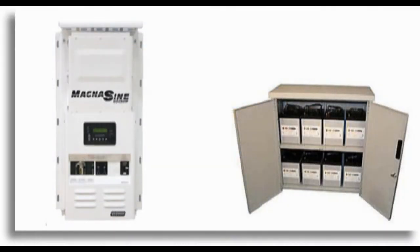The next system is a grid intertie backup. This is where you have batteries in place of a gas generator. It's a good first step into alternative energy — it lets you get a feel for batteries and how they operate. In this system, batteries are charged off the electrical grid. When the power goes out, the inverter kicks in and keeps your freezer, refrigerator, and the really important things in your house going.